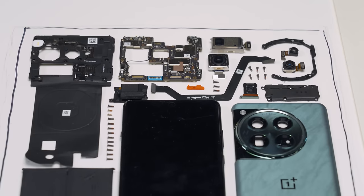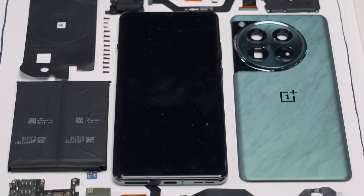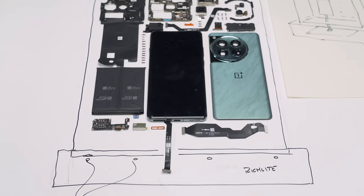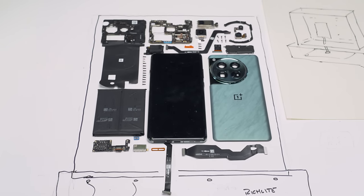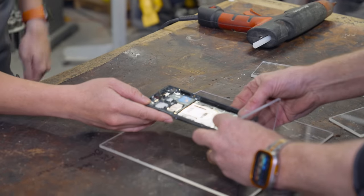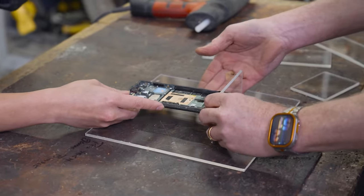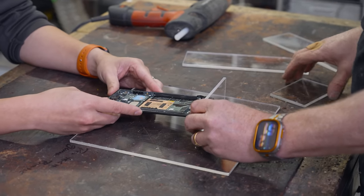Again, we're going to learn from our test pour today exactly how well it'll come out. And we're going to assemble that mold using just hot glue. It's the fastest way to be able to see every corner where there could be air coming out. All right, sounds like our next step, make that test mold with our backup screen. So that's going to sit, oh wow, it's pretty high elevation. Well, I was going to pour it thick for this test because I want to really see the worst case scenario, you know?